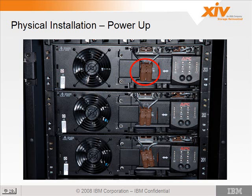So here's a picture of the front of the UPS. The decorative cover plate is removed, and you'll see that the cable for one battery is unplugged. You simply plug it into the port right up above. You can access the battery by removing these two screws. And the plate, you see this arrow right here, the plate slides and will hinge outward. Once you slide it to the left, it'll hinge open and you can actually pull the battery out from there.